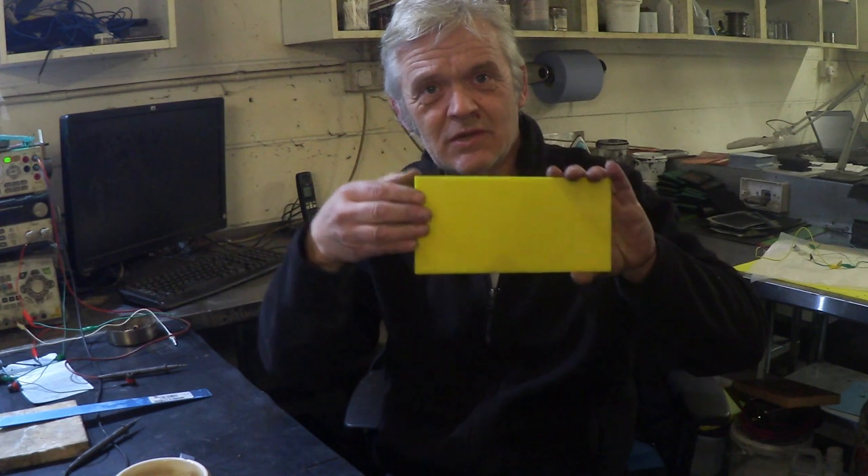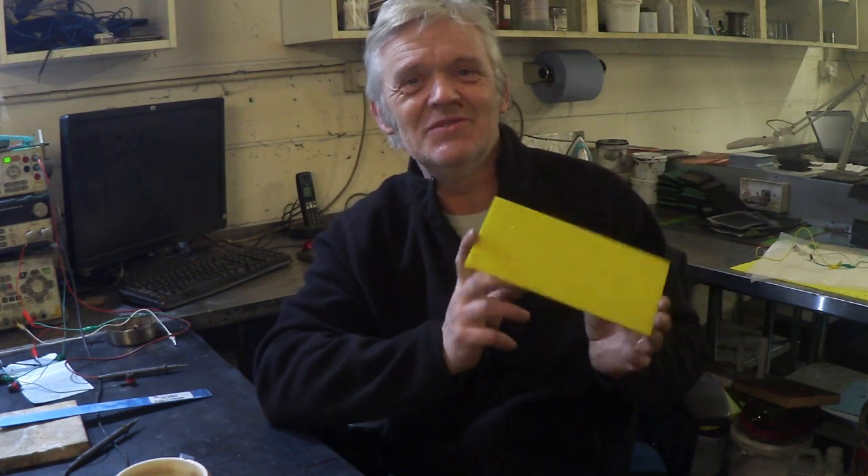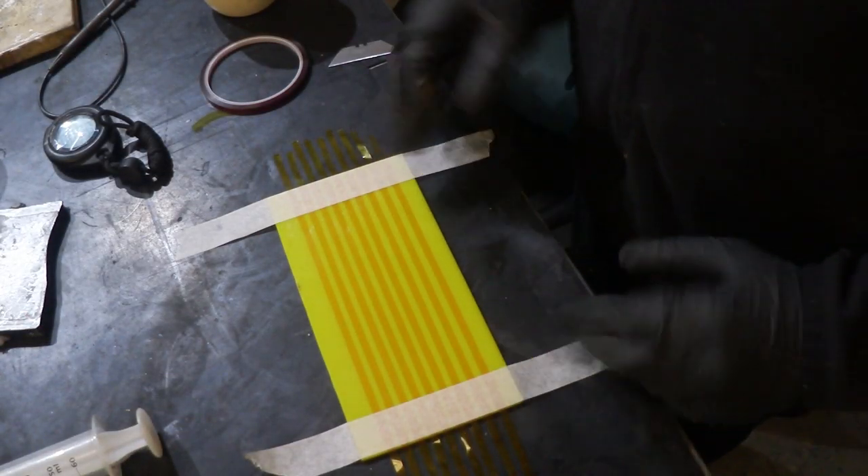So what I'm going to do is make those voltage dividers from our ink on this bit of plastic — dead simple. All I have to do is paint eight lines: these will go to ground, these will go to the input, and somewhere in that ratio of 1.4 to 1 I need to drill a hole, stick the Arduino input wire into that hole, and put a bit of paint on it. As long as I maintain that ratio and have a reasonable amount of resistance across that line, I'll have a set of voltage dividers.